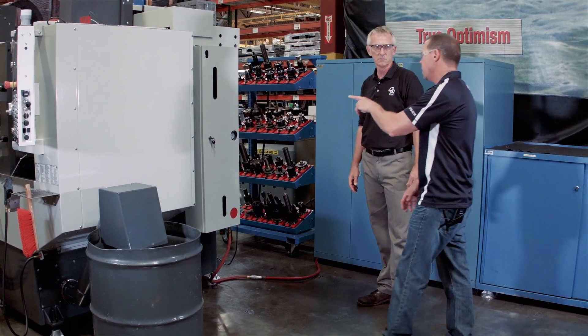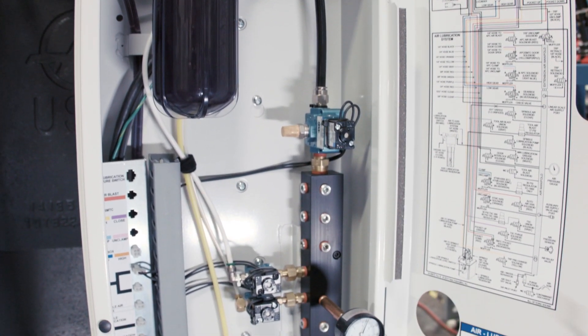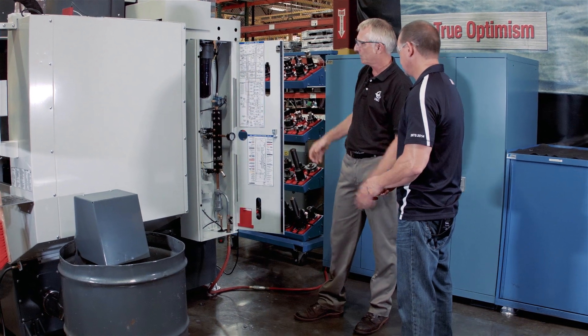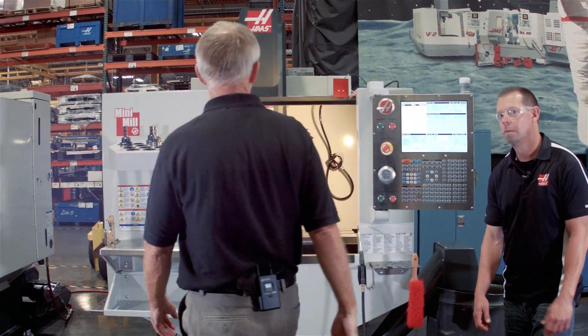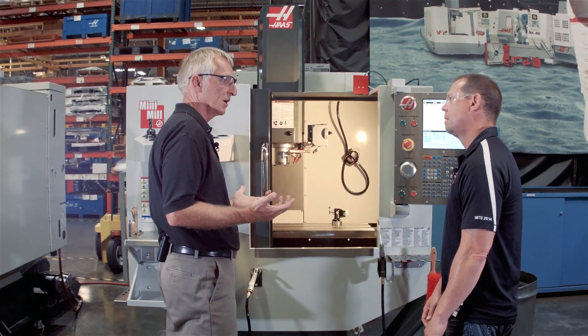Something I'm used to seeing on the verticals and now I see on the Mini Mill is this lubrication cabinet. The min-lube system is really kind of the heart of our reliability efforts — this is on all the VMCs. You don't have to add oil every three or four weeks now; the grease lasts for a year. We've got the solenoids out of the head, brought them down here in a cleaner environment — easy to get to, you see everything. We have our new air pressure sensor on there and all the color coding. Everything in the head cover is re-plumbed and re-wired for the min-lube system to get more coolant flow to the tip. The cable carrier we have on top now is different than that old tube — it makes it more reliable, more room, easier to run things.